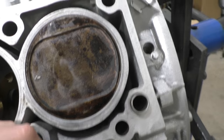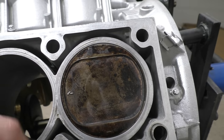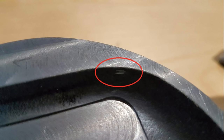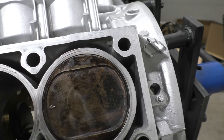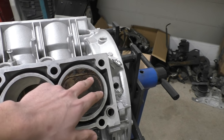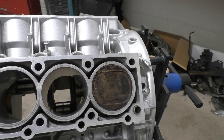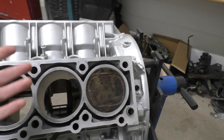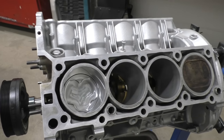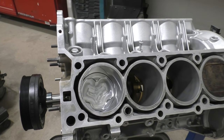These are pretty good numbers — it means we can really play around with the valve timing and do whatever it takes to make this engine flow better. Even if it does run into valve float while revving extremely high, there's almost no chance of the valves hitting the piston. This wouldn't have been the case with the factory AMG pistons, because those ones don't even have a pocket made for the exhaust valve, and even on the intake side the pockets are actually wrong — the valve hits the side of the pocket, so the intake valves can only move about 2.4 millimeters before hitting. This design is going to provide a lot of benefit for taking this engine to extremely high RPM.